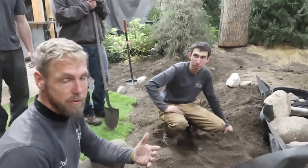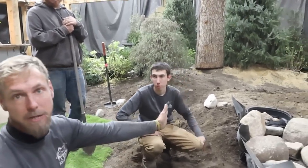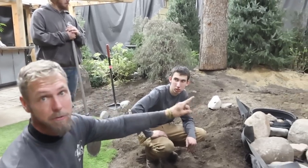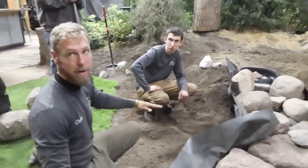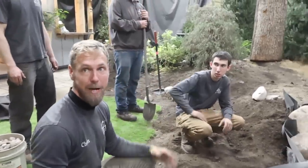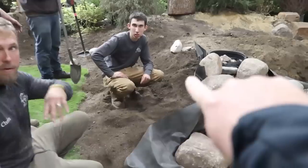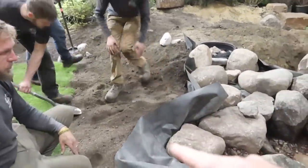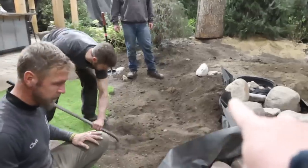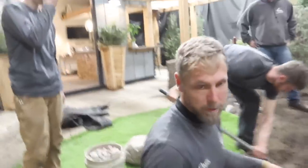How's it going? We are close. I was explaining to them retaining walls and the importance of the wing walls — not to try and push those retaining stones close up to the bio falls, but bring them all the way out. We have all the extra soil to the right of the berm; we can move some of that over here, really fill this out. This will be excellent for planting and give it that more natural sunken feeling. Too many times the berm goes up like this and it looks like a volcano, so the wing walls should come way out almost to the grass and then have soil in between for plants.